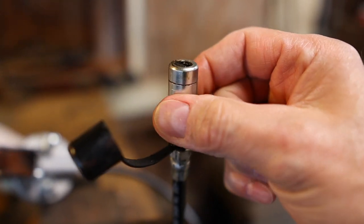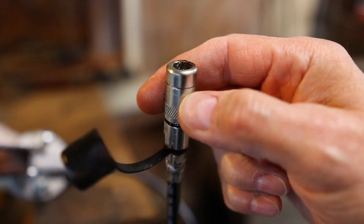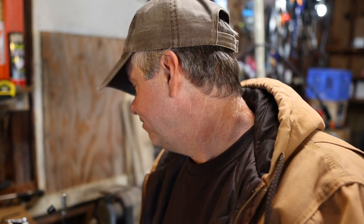Got it. I'm going vlog style here for just a moment because I was inside editing and was really frustrated about that grease gun fitting getting stuck on the Zerk fitting. I did some Googling and saw suggestions about this collar on top of the fitting — that if you loosen it, it can work like a chuck or collet situation and release from the fitting. I went back out to the tractor, got it stuck again, tried loosening the collar — it was difficult to do with the pressure on it, but I was able to release it. It didn't seem to work for me with this unit, so if that's one of the solutions, it was a no-go. If you have any other ideas let me know. I may have to look into the Lock-N-Lube and see if that does the trick.